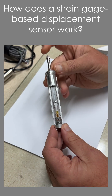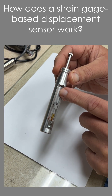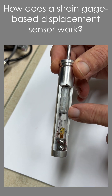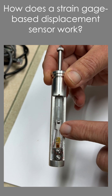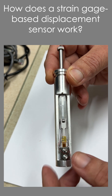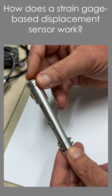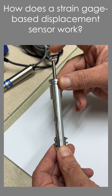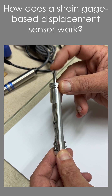The way this thing works, you can see the plunger going up and down. This is a wedge — it's hard to see in the video, but this is actually a triangular shaped wedge. What you see here is a constant stress cantilever beam with the contact point being this bearing. It's cantilevered, and there are two of them — one on this side as well. As this displaces, you can see those constant stress beams deforming and rolling on those bearings.